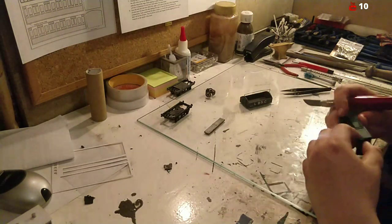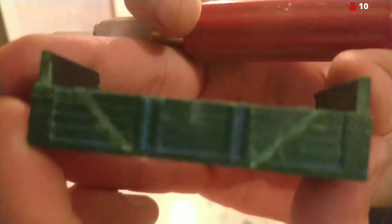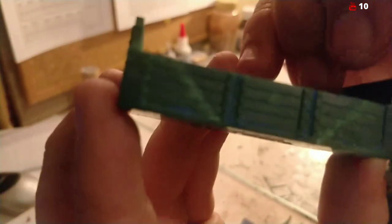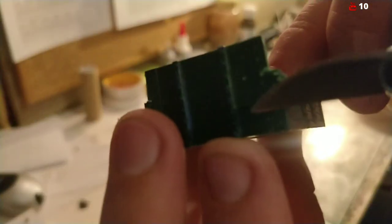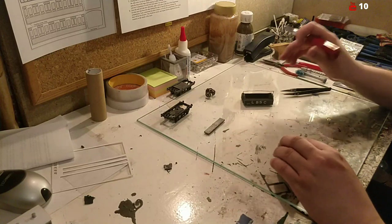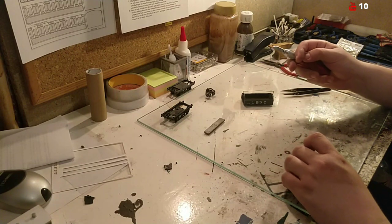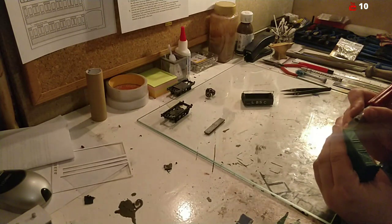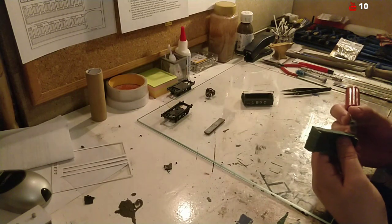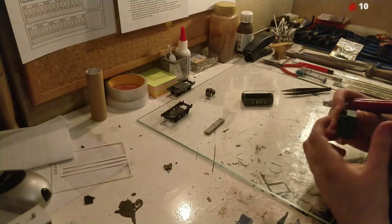Now, these wagons. The triangle ones of these. So, focus camera, you can see the planking kind of. But the triangle ones have two sets of rivets down here, and one down the end. The actual Brighton ones only had the one set. I'm not sure you'll be able to see on there. So I just remove one of the sets of rivets, which in this case is the outside set. I did compare that to the drawing to know that was the one to remove.